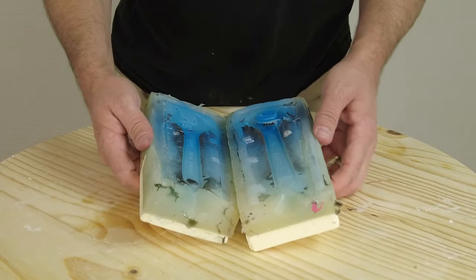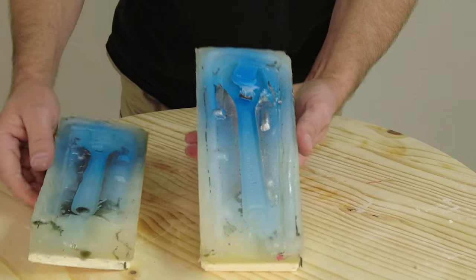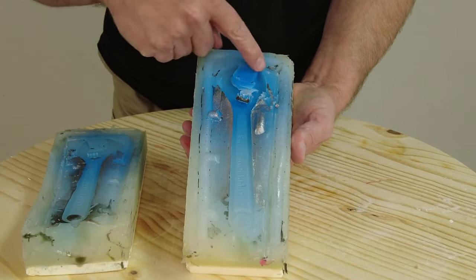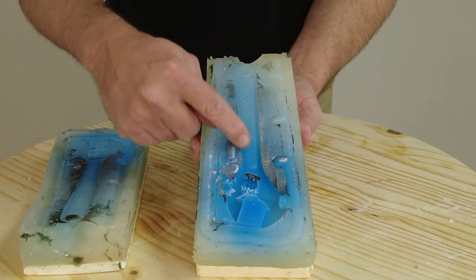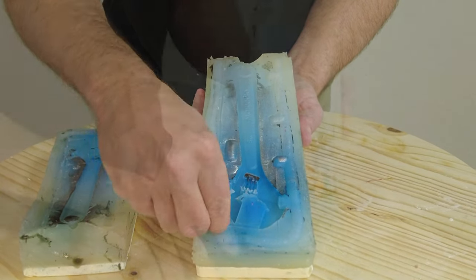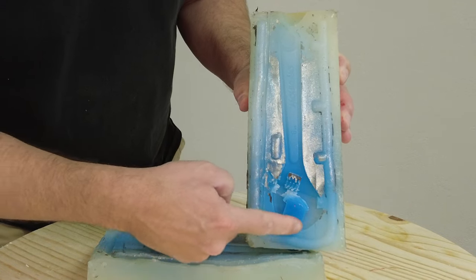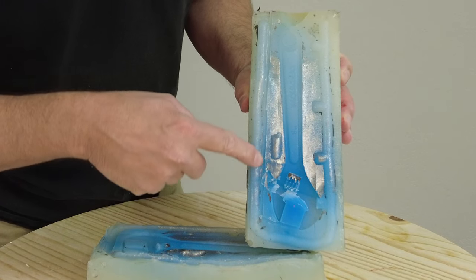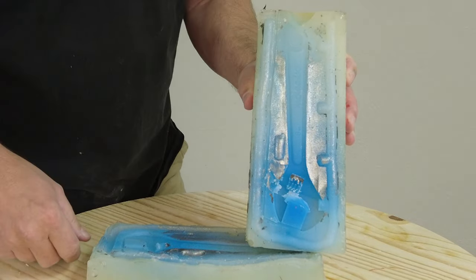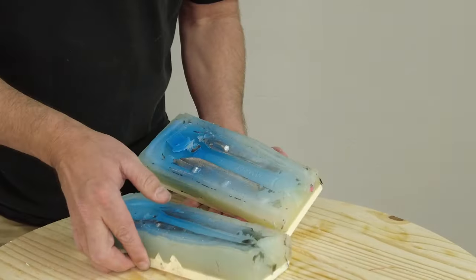For casting we're going to be using a 5130 silicone mold. The 5130 is a platinum silicone, and we recommend platinum silicone for casting any of the FP series materials because tin-cure silicones can sometimes inhibit some FP series materials. What I'm showing here is the vent system — those little trenches going up the side — which allows the casting material to be poured in via syringe while air escapes around the side and up the top.